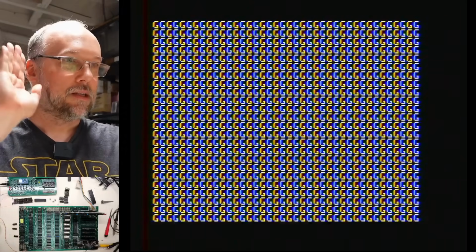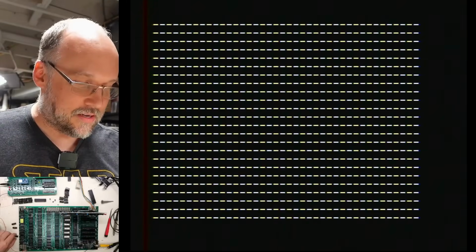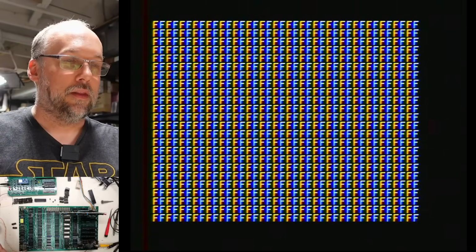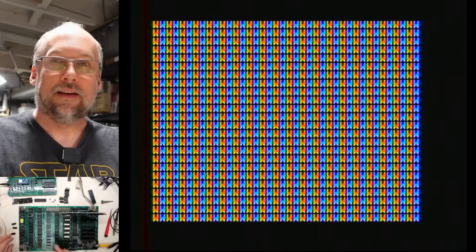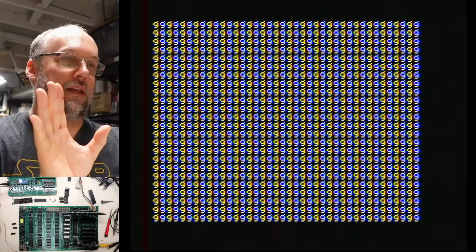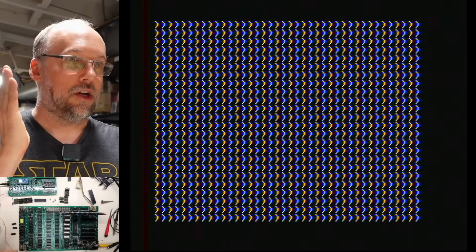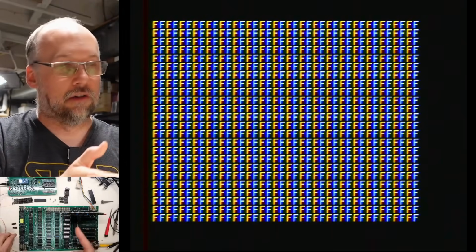Okay, that is fascinating. So this is telling us that there definitely is some kind of interaction that when this bit 7 chip is in the motherboard, it's corrupting all of the signals. It's not just corrupting the data bit 7, like causing some inverted or not inverted or whatever. It's corrupting everything. And what's weird is that with the chip in there, the upper 127 characters, remember, starting from hex 80 all the way to FF, still display correctly. It's only when data bit 7 is set to 0 that it starts corrupting everything.